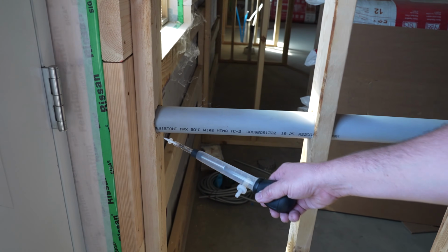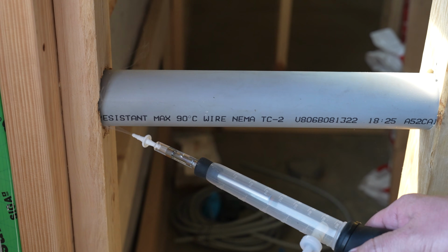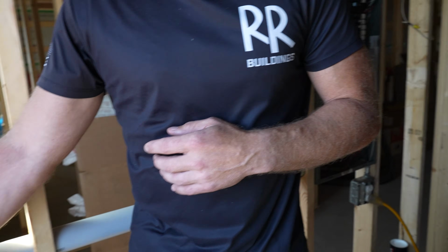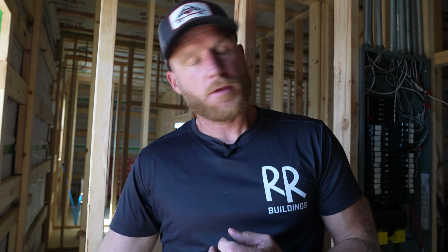Oh, what about this one, Dan? Try this right here. See, that one's not too bad because that's sealed on the outside. Still leaking. That's your LP. Well, this goes through a column and out to the Weather Logic, so really it's basically sealed with lumber. So it's not insulated around that pipe. We could shoot some expandable foam in here, or tape. It's taped and sealed on the Weather Logic, so we're at least using the exterior air and water control layer. Did you see that down there?